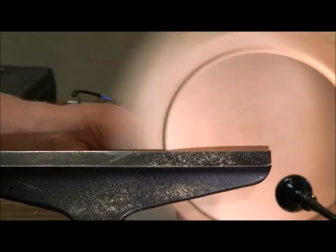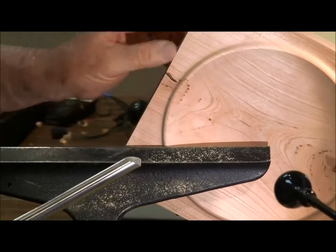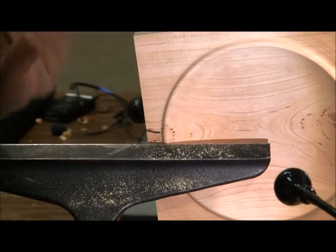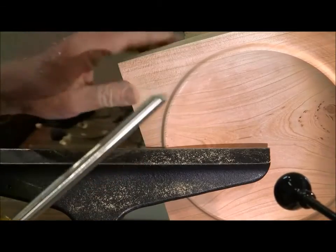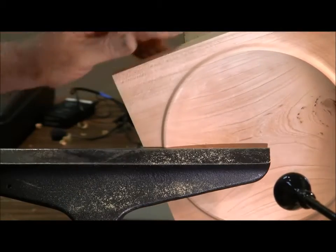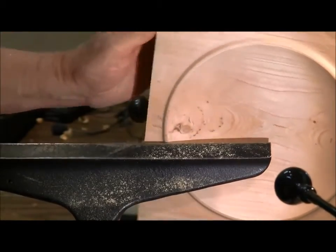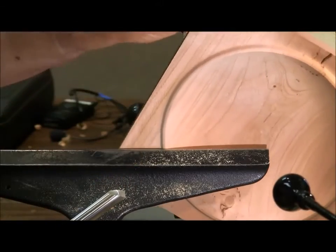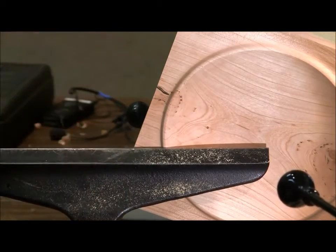Ever want a shear scrape on something like that? The question was, would I ever want a shear scrape? You can, but you've got to have very good tool control and not get the yips where you might push in. Because when you're out here making an abbreviated cut, you can get a snag that can scare the hell out of you sometimes. So I don't like to do too much out there like that. But you could do a shear scrape, yeah. But this little bit that's left here will come off in 2 minutes of sanding with 80 or 120 grit.